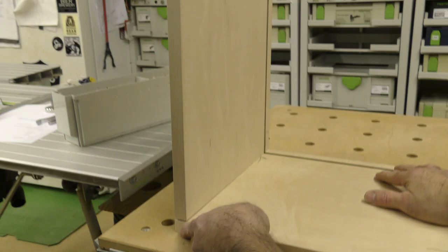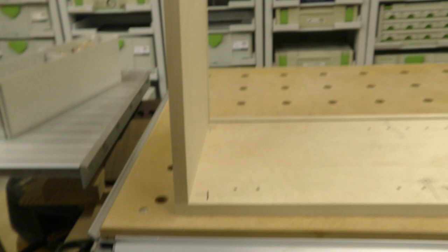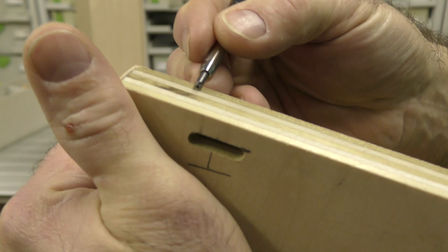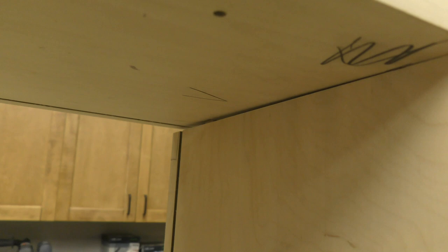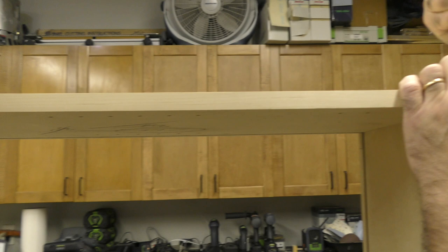Find the tight Domino first, let it fall in, and look — perfect here and perfect here. Big D — that's a perfect butt joint. Now this is important: that mortise is 15mm deep, and the plywood is 18mm, so you're down to about three millimeters — maybe one ply. When assembling, never jam it on; ease it on. Find the tight one first, then ease on the other — look how that comes together, absolutely perfect.